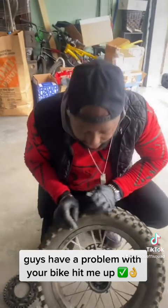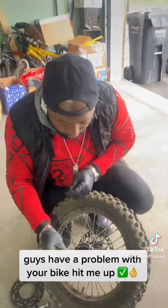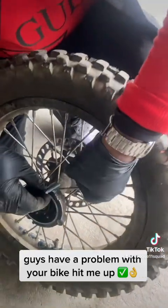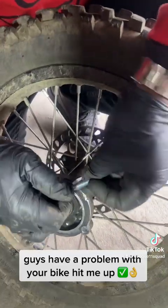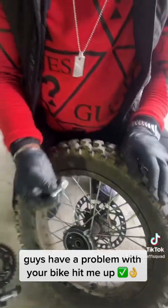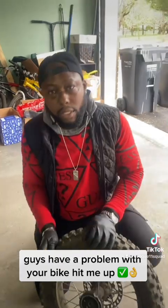What I did is I put a longer bolt through. When I put the longer one through, I put a nut on the outside like that, and I use the extra strength red Loctite — so this one cannot come loose again.